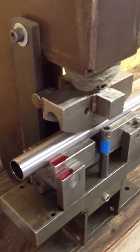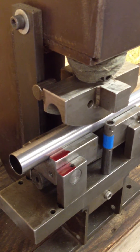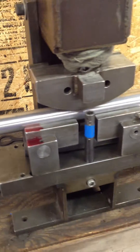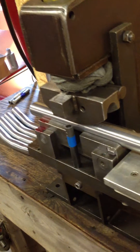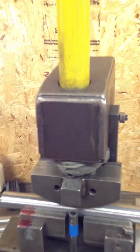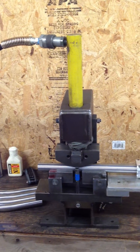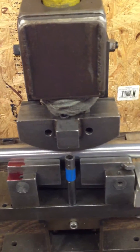Speaking of fully encapsulating the tubing, you can see that I have different dies made up to encase the tube. There are two that it rests on, with individual pivots, and then a third that actually has the curved bent shape milled into it that acts as the arbor press, so that the power unit above can have its stroke pressed down on the center, allowing the two bottom cradles to move in.